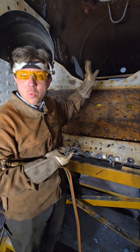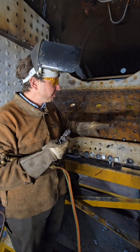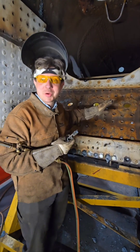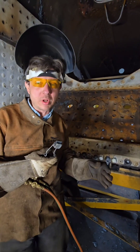Some of you heard about why we're replacing the barrel — the holes weren't running straight and everything. Well, we're replacing the rest of the inner throat because we're having to replace all of the outer throat because of cracking between the holes, which is not uncommon in a really old boiler.